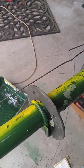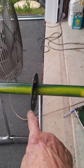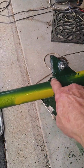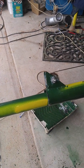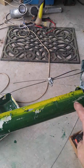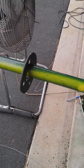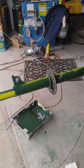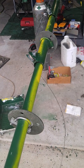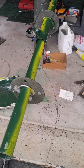This is over 60 thousandths of an inch thick. I've cranked it up a little bit — if you take notice, you'll see where the top hat's sitting. This used to be all the way up against here. The real beauty of this system is with two pipes and two pulleys, when I crank up the length about 18 inches, the other pole goes 18 inches. So I'll get a two-to-one mechanical lengthening. As you crank it up, the center section moves up twice as fast as the inner section.